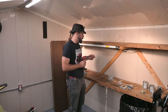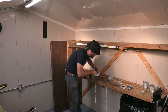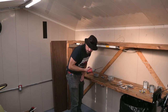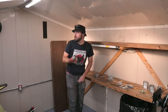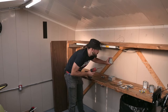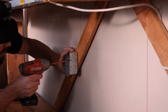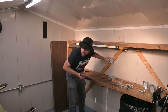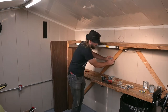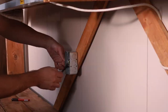Should I pre-drill? That stupid ground screw sticks out too far. You don't even need it because it's all conduit grounded. They also tend to get stuck on your bit. Nine and a half. Center it on there. Maybe I should level this to make sure it's level — just kind of eyeballing it. I'm going to put a conduit connector right on the end here.